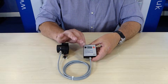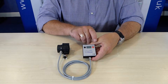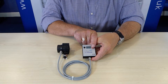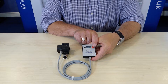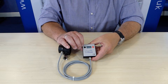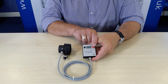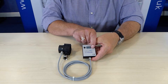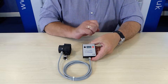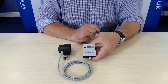To initiate the programming, press the program button, then the reset button will establish the number of litres 1 to 10. We then press the program button to move to the next column, which is 10 to 100. We press the reset button to establish the number, then press the program button, and we keep doing this until we've reached the capacity calculated on our capacity chart.